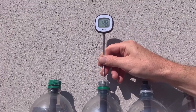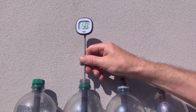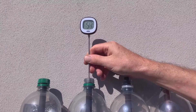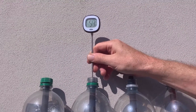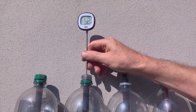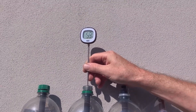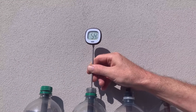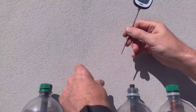This is interesting — this tells us that the other heat pipe we painted black maybe didn't have the right water ratio in it, so we need to go back and check that. This second black-painted one is more what we were expecting — the black painted one actually being hotter than the bare copper one, and this would certainly bear that out. We're at 52 and still going up... 53... 54... topping out at 54.3 degrees.